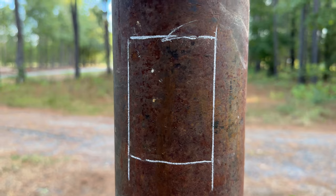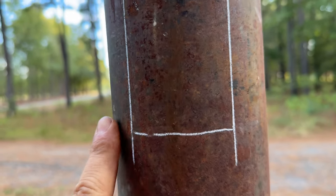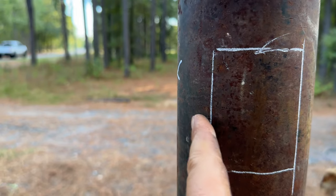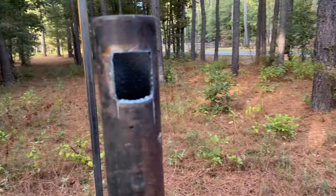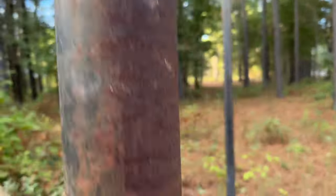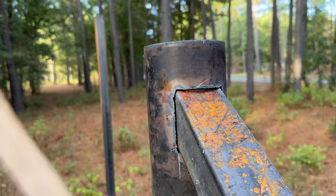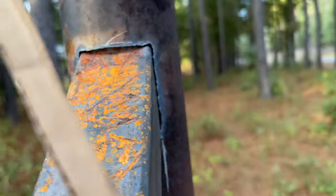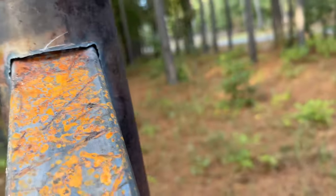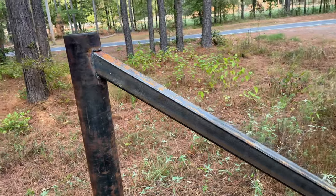It'll look like this when you're done, but you're not done because this is round and tubing's flat. So this is going to have to be cut at an angle up, and these sides are going to be straight — not angled — straight into the side of the pipe. It wants to kind of blow out the side because it messes the flame up. Here's one I've done already — that's about what it's going to look like. I haven't ground anything and it actually fits pretty good. It fits in there really nice — that shouldn't be any problem to weld. And you can see how it goes down to my next mark. I just had to whittle on it a little bit to get it to go that way, but it's getting faster all the time.